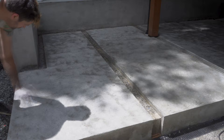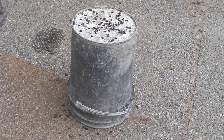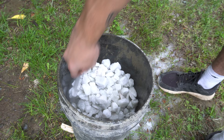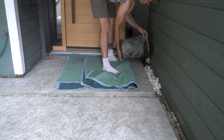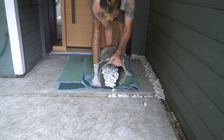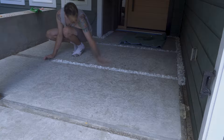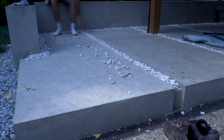To help the 4 inch gaps look more appealing, I filled them with white decorative drain rock. Because the rocks had a white dusty sludge on top, I drilled a bunch of holes in an old bucket, filled it with the white rocks, and washed out the white residue. I then consistently poured out the rocks into all the 4 inch channels. The rocks allow the rainwater to drain away from the house while also giving it that modern decorative look. For an area this big we used the best part of 10 bags, working the rocks slightly below the top line of the concrete pavers so they don't kick up when you walk over them. And then this job is complete — I am so impressed with the dramatic change this brought onto this house. The concrete pavers look fantastic.